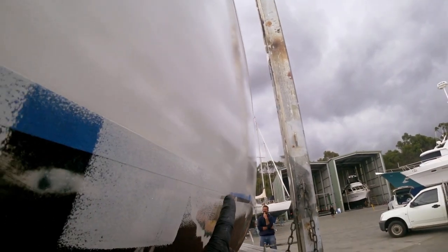Where we removed the seacock it's gone — look at that. We've retreated into the boat because it's blowing 30 or 40 knots out there. It's a no-rain day today and I've just finished sanding and wiping down the old antifoul off the hull. We did the big sand but just did a final touch-up for spots we couldn't get to. Troy is mixing the antifoul paint and we're going to put at least the first coat on today. We'll do a time lapse since it's really windy out there.